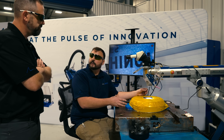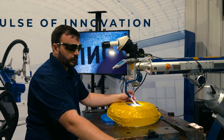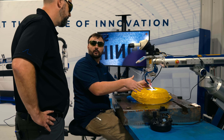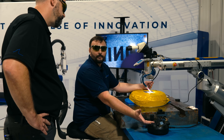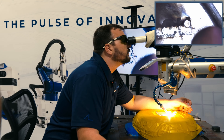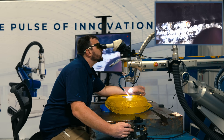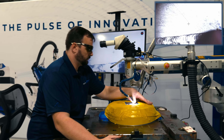Essentially, this repair could be done right in the press — it doesn't have to come out. If you could weld it in the press, you would also save all that time from breaking down the mold. In this case it took a full day to break this mold down from the base plate, not factoring in the time to get it out of the press. And with laser welding, we don't have to preheat it. We can do this cold. Because we're just doing a simple engraving fill-in, we don't need any preheat whatsoever.